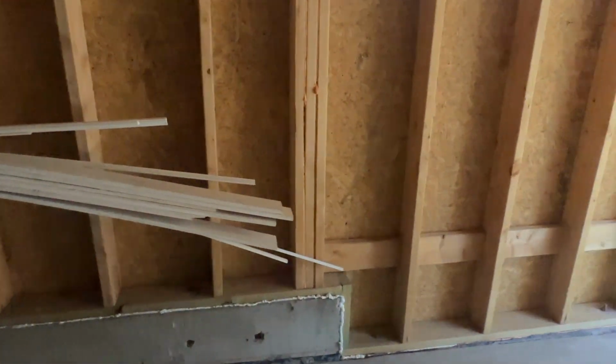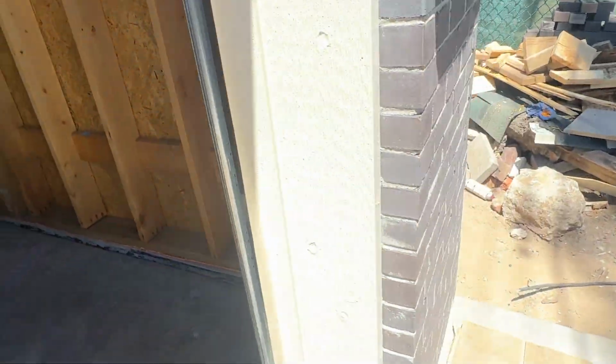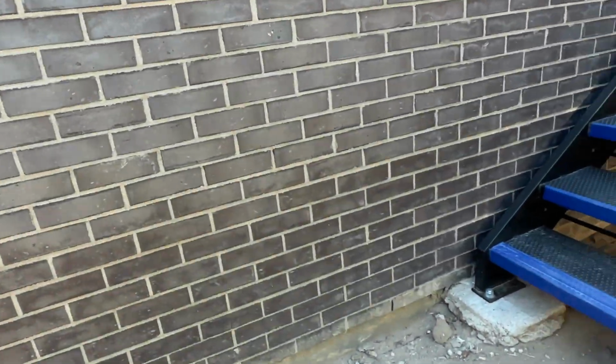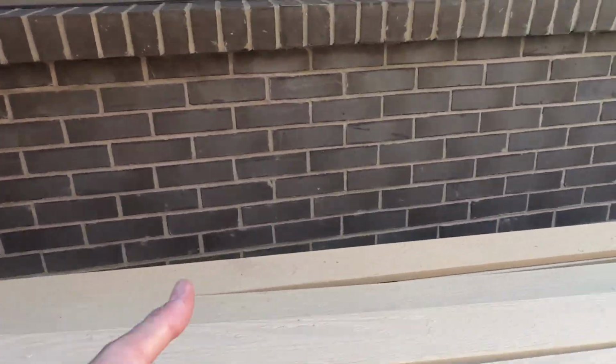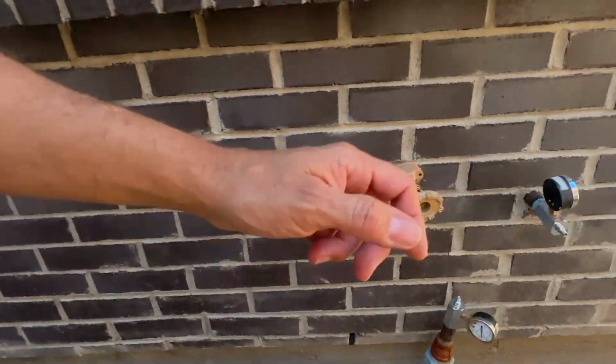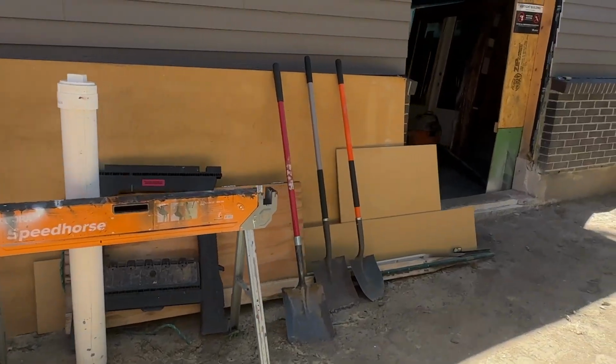But yeah, so the last step to connect the foundation wall to the sheathing, and so basically wood to concrete connection on the exterior, and you can't see it anymore because we got brick all the way around it, but we have Siga's Fentrim that runs all the way around. So we got several layers to stop bugs, an air barrier and water barrier along our foundation wall.